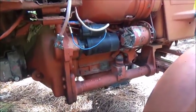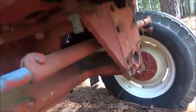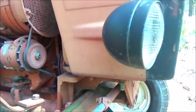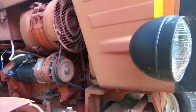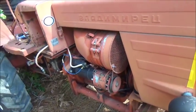And let me see, I never looked in the front. It's possible I could run a pump off the front. They actually got a T-slot there for what looks like a hand crank, but this cover could come off. We might be able to machine the front of the pulley and make an adapter to bolt on there, or like I said, just run a PTO hydraulic pump. They're just expensive. I'm looking at $500 for a hydraulic pump to be able to run the backhoe, but it would be worth it for what I've got in the tractor and what I've got in the backhoe.